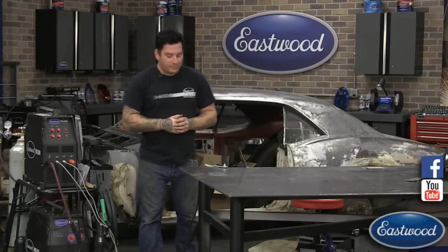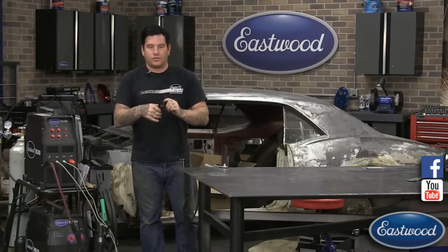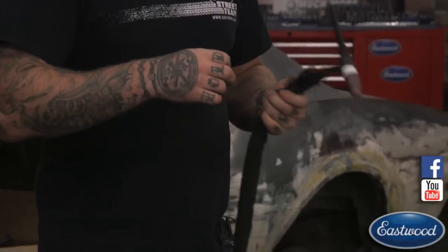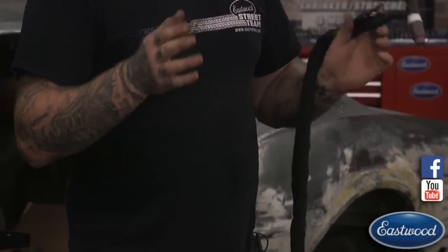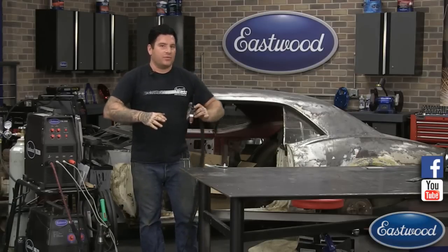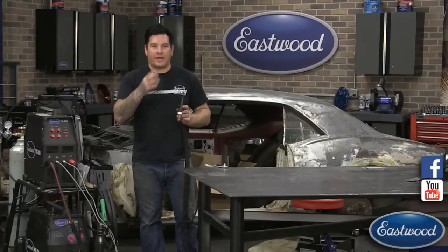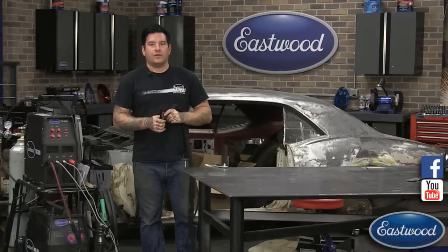Today's topic is TIG welding, and specifically I'm breaking it down into TIG welding torch angle and just how to hold your torch. A lot of beginners start to get the idea of how to TIG weld, how to lay filler rod in and get a puddle going, but as soon as they get out of table welding where they're just welding something simple, they forget about their torch angle and start having problems where the filler material is melting before needed, or they're burning into their panel and burning holes.